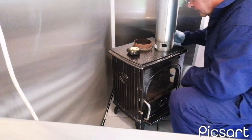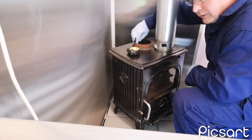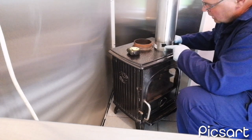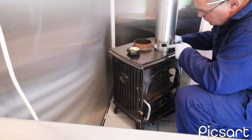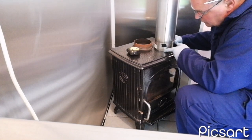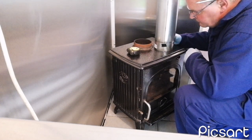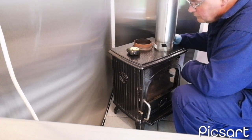Hi and welcome back. In the way of prep, I've measured the depth of the inside of the collar and marked it first with pencil on the male end of the flue pipe, then put a bit of tape over it so I know when cutting I'm not going to go beyond that mark — because then it will extend above the collar.